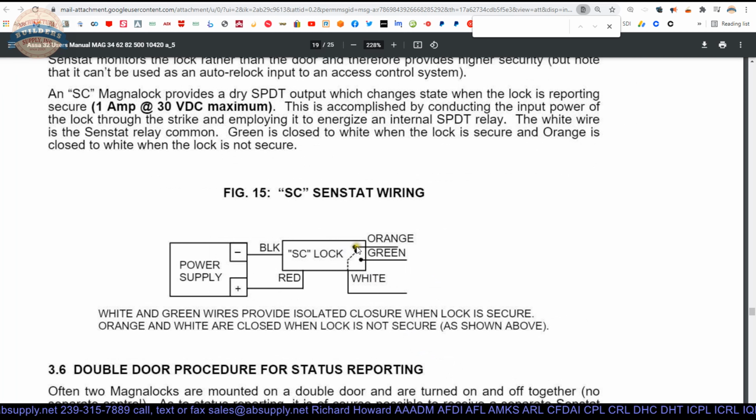Basically what this switch does is, when you take it out of the box, it's going to be normally closed. When you wire this up and close the door, that's going to throw that switch to normally open. So that means that when the door is opened, it's going to fail closed, which means it will complete a circuit. You can wire that in the opposite orientation as well.